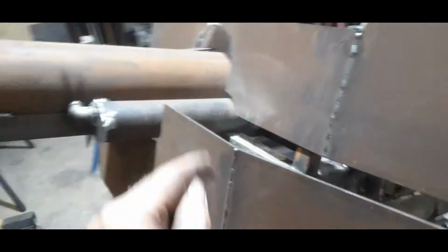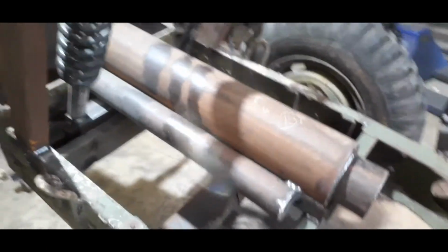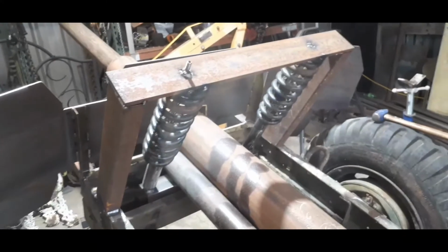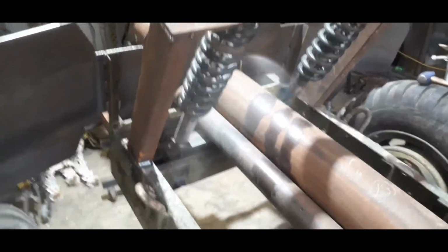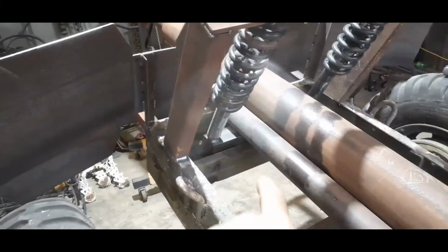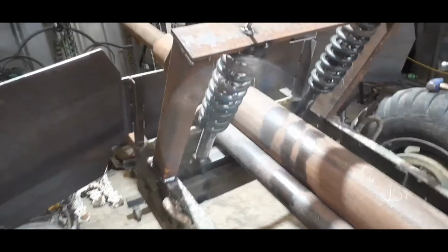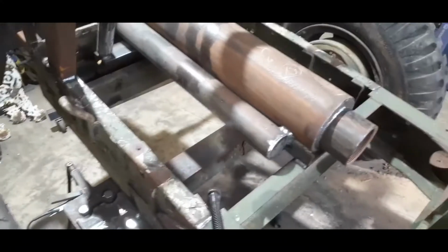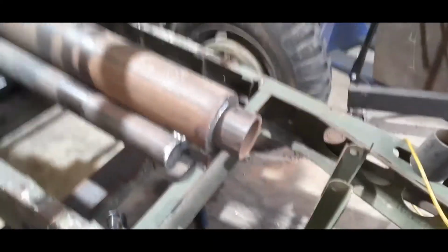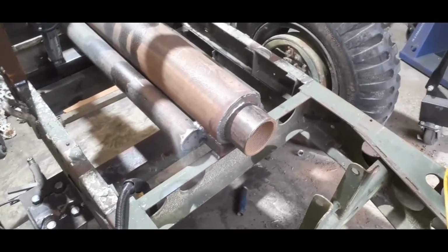Made these little deflector shields. We sliced them and bent them and then welded them back. I'll grind that off smooth. I looked back here in the back and it was kind of bare bones. Some of the pictures have some coil-over elevation assist springs. So I took a piece of channel and put it down in there and tied some struts to it. Got some coils from a suspension off of an old truck. Here's the back end. 4-inch coupling.